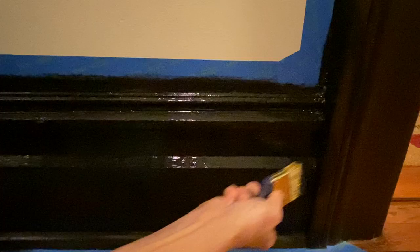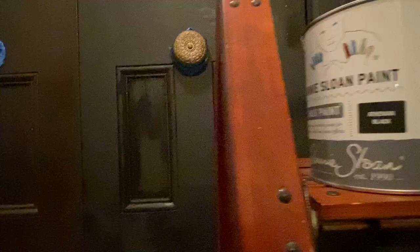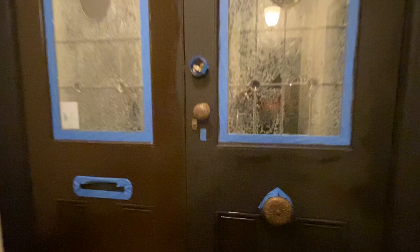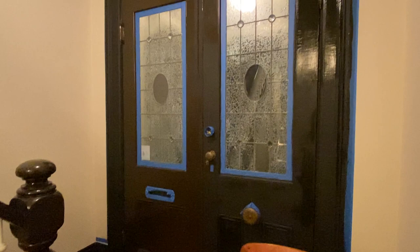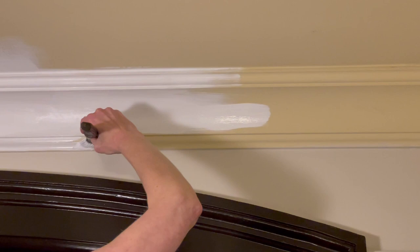Because the chalk paint is super thick, I added a tiny bit of water as I went along, which helped with the viscosity so it could get into those nooks and crannies. The same went for the staircase — there were so many knocks and dings on the spindles because of their age. Ultra matte paint is beautiful for making things look flatter and smoother than they actually are, which is really helpful on that old staircase and floorboards.